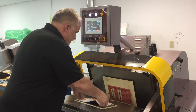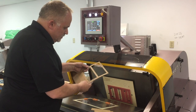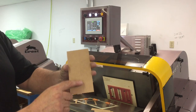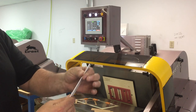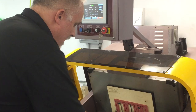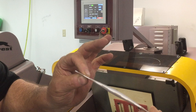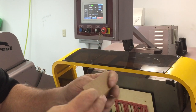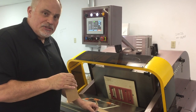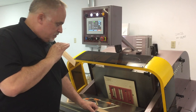Zero make ready. There's the parts. Here's the creasing. And we even got a half-half counter combo in position. Once again, showing the full flexibility of the machine to be able to register a steel counterplate on a hand-fed clamshell in a matter of seconds.